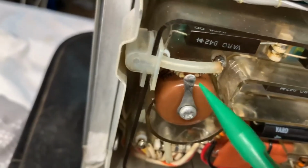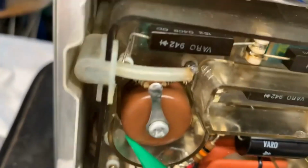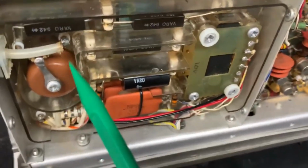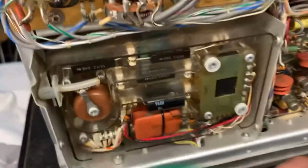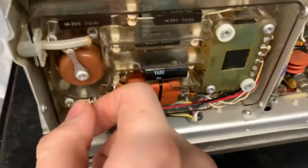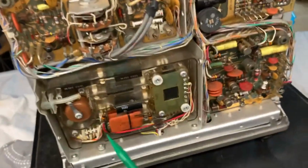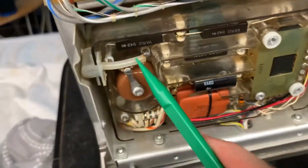Oh wow, look at that. That looks like a ceramic. Yep, that's labeled Sprague. That has got lettering on it. Guess that's a really high voltage. That's a high voltage ceramic capacitor. You don't see that these days in CRT drivers. You've even got a trimmer on here. Oh, I twisted it. Now it's uncalibrated. Now I uncalibrated the entire scope, and it's not compliant anymore, as the European Union would say. Here's your cathode ray tube output.